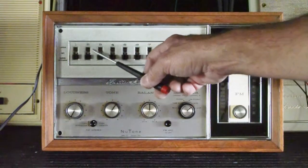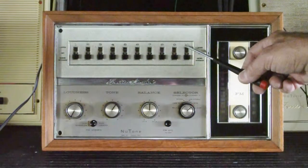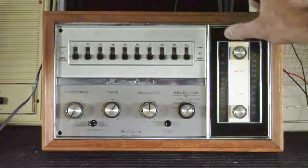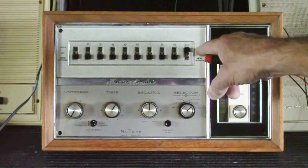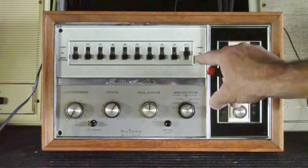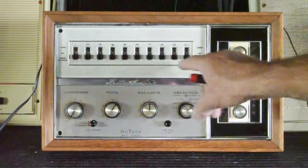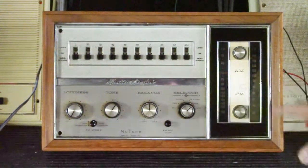You have your room control selector switches. This system is designed to handle up to 10 stereo pairs of speakers, which gives you 20 speakers for a full system. Your selections are: you can put a station into listen, or monitor, and listen into sounds in that room. You can turn a station off altogether — no radio and no intercom. Or you can move it down to the radio intercom position, which is where most systems are set all the time. And then you have your AM and FM tuning dials.